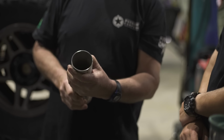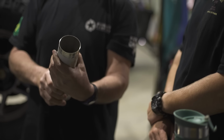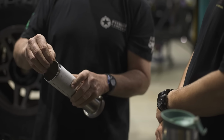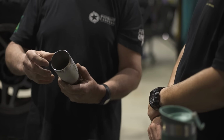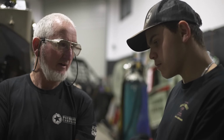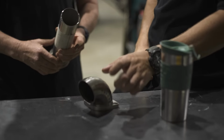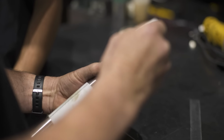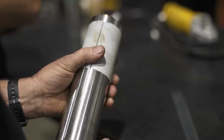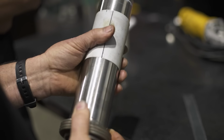Your first one, which is like that angle there, then you come down, you turn it round, get your 15mm at the back here, line that up and then trace it around, so that just gets turned that way and then back that way and back that way, which gives us all that. Which is all perfect. So every time you turn it over, you scratch that on there and then you put your bit on here, scratch around it, and then carry on. And the next one will be the other way.